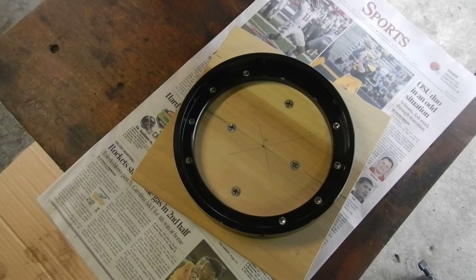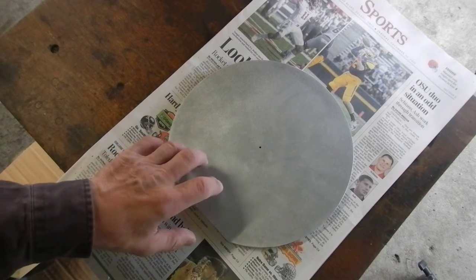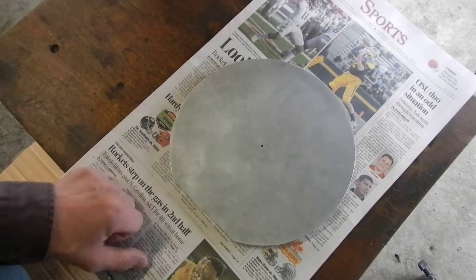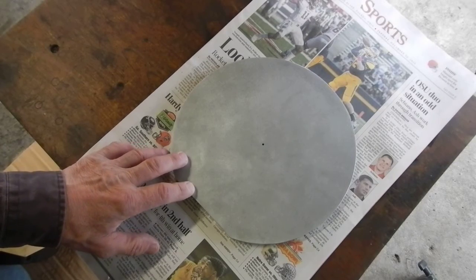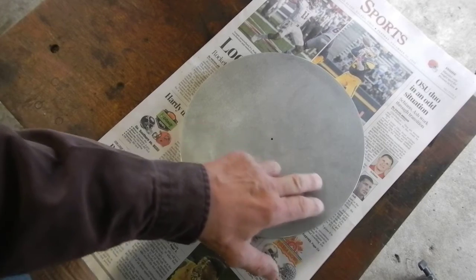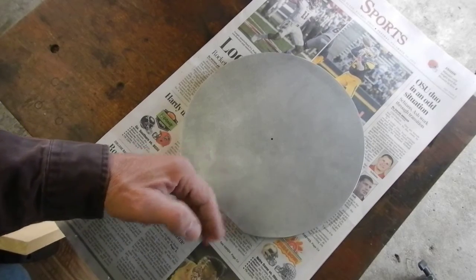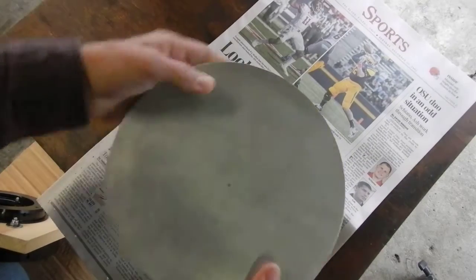What I want to do today is I got the aluminum plate machined, and so this is the plate that I got from the machine shop. I originally bought a piece of aluminum, 3/8 inch thick by 15 inches by 18 and 7/8 inches — a drop that they had from Tri-State Aluminum and they even shipped it to my house. Then I went to Royal Tool and Machine in Northwood, Ohio, spoke to Massimo, told him exactly what I wanted: a 3/32 hole drilled in the center of the plate, and a flat put on the back to match up with the flat on the backside of the 1100 mount. They did a great job — nice and smooth.